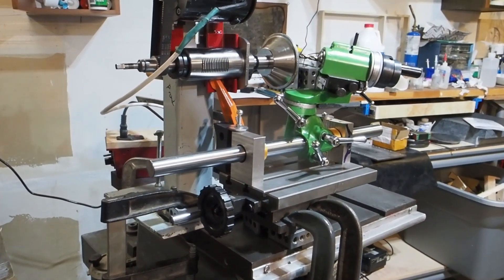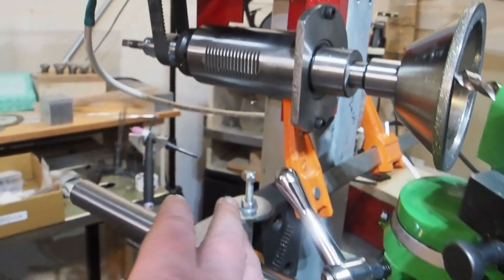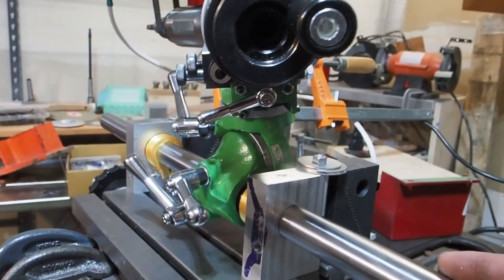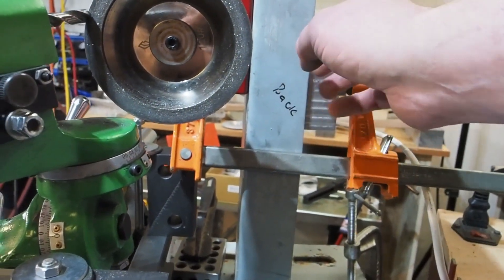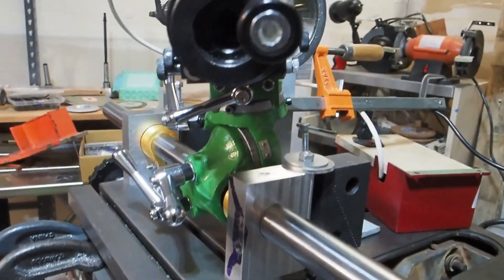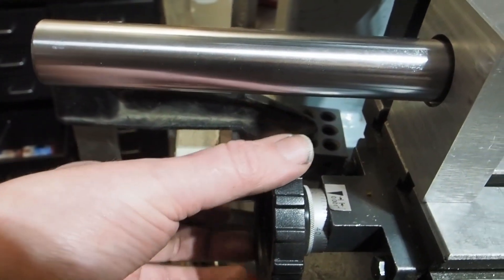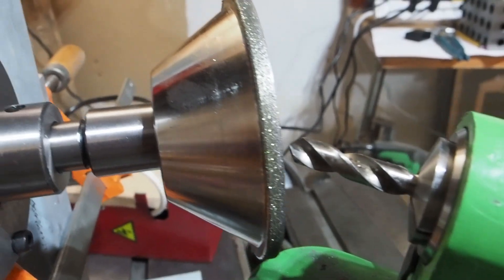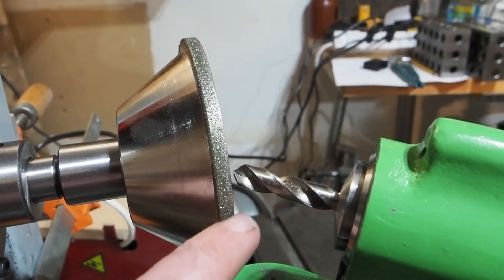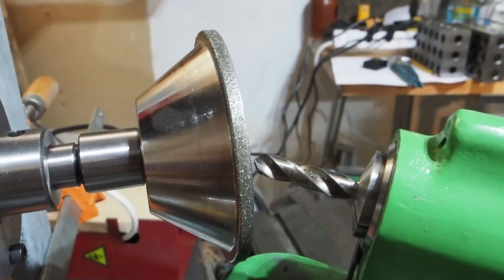Hey there, Internet. So I have mocked everything up. Here's my setup. Got some strap clamps holding my blocks to this table. I've got the motor on this thing - it's quite flimsy. I'm a little worried about that, but it's clamped down to this cast-iron table. Down here I've got my feed, and that feeds in and out of my wheel. I'm going to attempt to do a four-facet grind on this ratty old drill bit and see how it comes out.